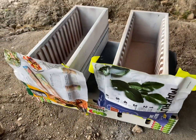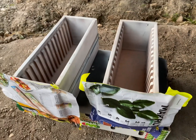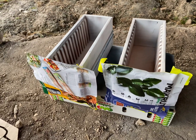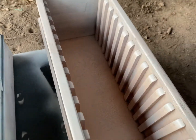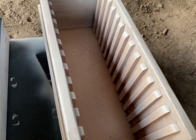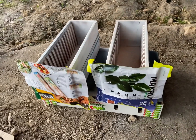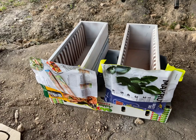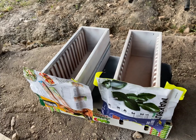Okay, so looking back at the drawers, you can see there's quite a bit of bleed through. So look, I really did kind of expect this. I was just being a bit lazy. So that's what it looks like if you do not prime or prep your piece properly. You'll get bleed through and it will look terrible. So I'm going to wait till that dries, sand it a bit, and go back in there with my stain blocker, the Dixie Belle Boss, which you saw me use earlier.